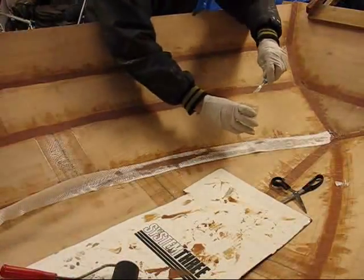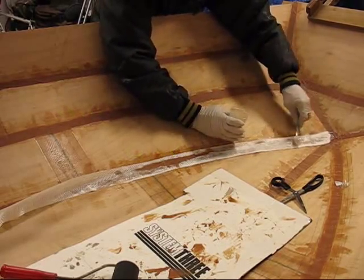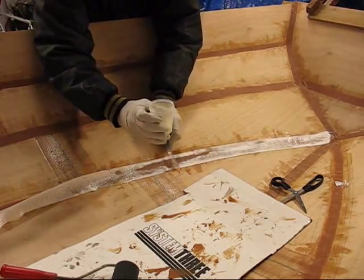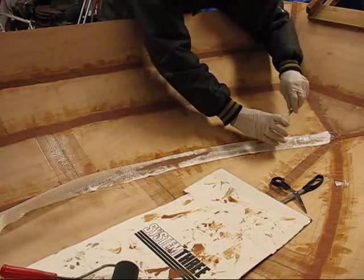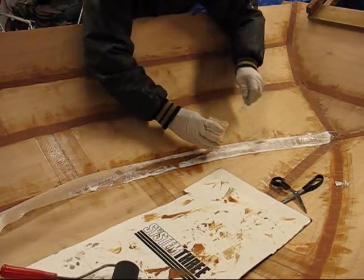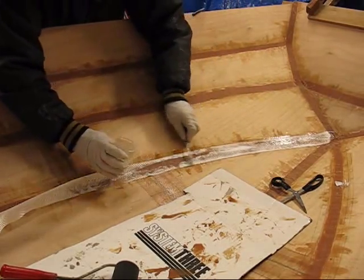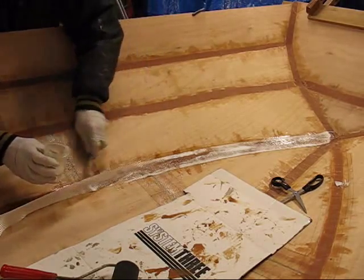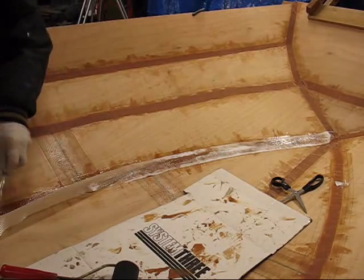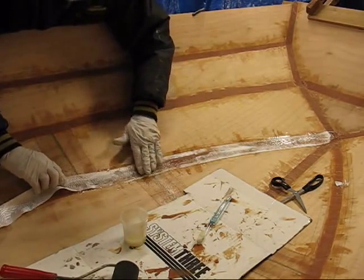Okay, it started. I'm going to go back a little bit out of distance here. I'm going to come back and give this a good wet down. Use your brush to scoot it back on the lines and carry slack. Get a good wet out down near the end here so it doesn't start creeping on you. Put down a pretty good thick pre-layer. It'll come up and we'll use it again when we start putting the 3-inch down.